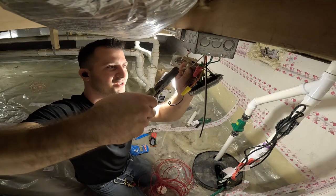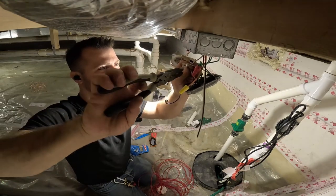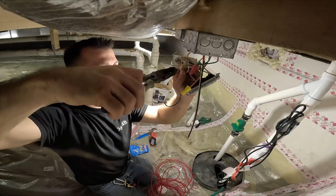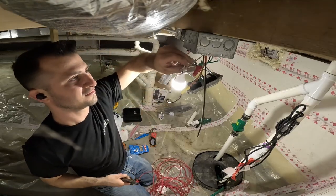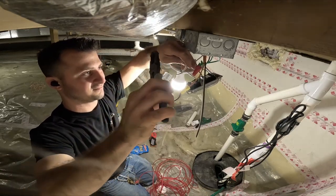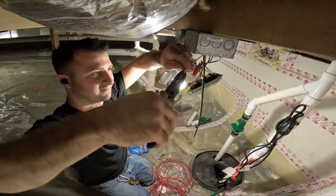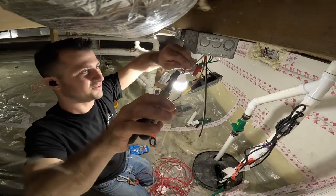I don't blow anything if it's connecting to neutral? Well, it shouldn't, because it's the end of the line for the outlets. You always want to be careful disconnecting neutrals, live especially. You can still get hit on a neutral.